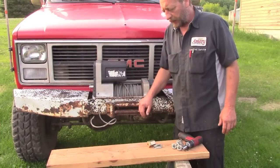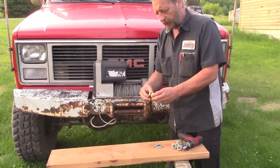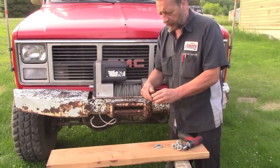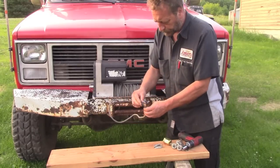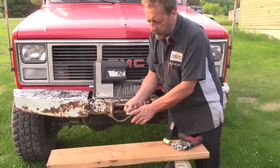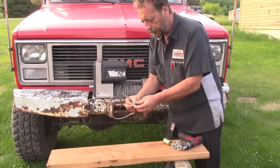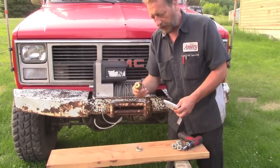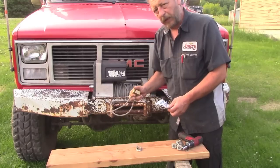While we wait for the paint to dry on the hook, I thought I'd take a minute to show you what my plan was. I found this wedge clamp here from a tow truck supply outfit, so that's what we're going to use. My original intent was to do what they call a Flemish eye — that's where you take the cable and divide the wire wraps in half, then take the two halves from each side around the thimble and weave it back over itself.